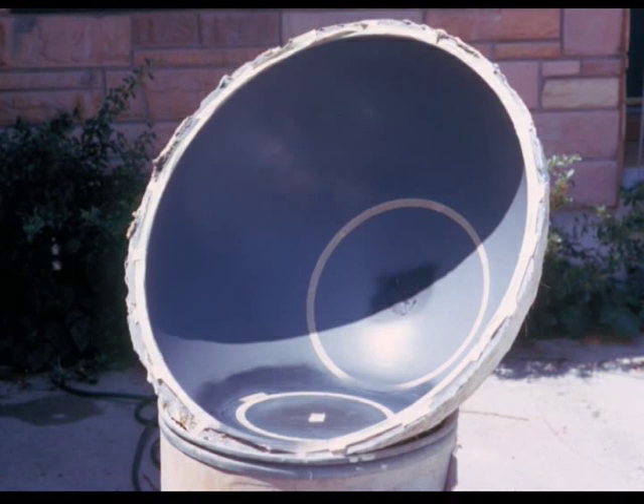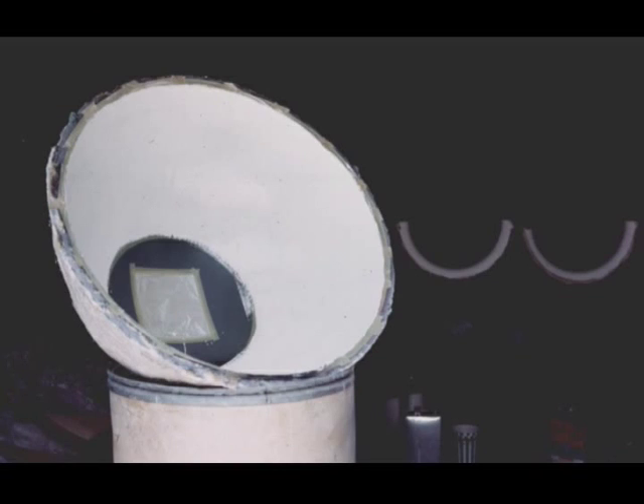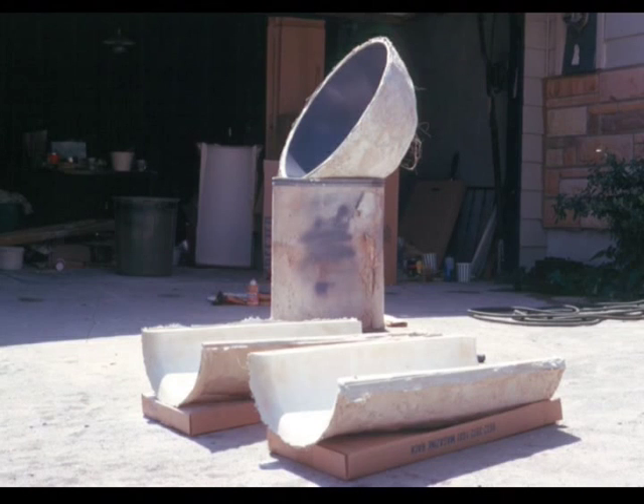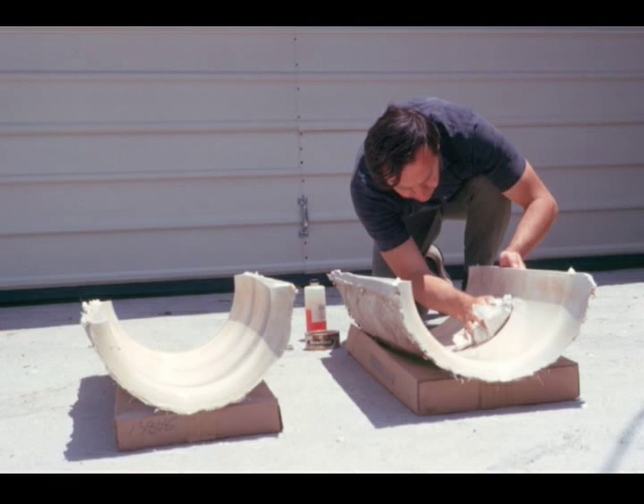Below that you will see a flattened area that's been laid in and built up to a smooth transition to give a clean surface to make an access port from the side. In this view the gel coat has been applied to this assembly and then the fiberglass resin and fiber layup made to build up the same thickness again. In this view all the tooling is shown set up to make these parts. The tools are waxed to a high polish, then the PVA parting agent is applied, and then it's re-waxed again.